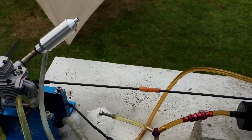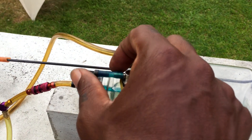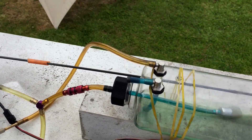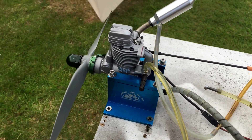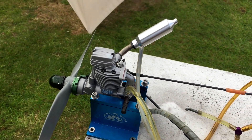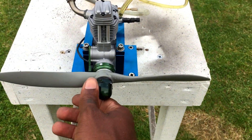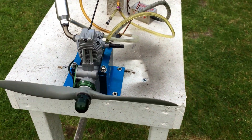I'm using a quarter-inch 32 spark plug, pressurizing the tank. I cap off the tank with a nipple, and I use a normal WD carb vent cap. The tank is pressurized and the engine is pretty much brand new — first start was about 10 minutes ago. The prop is on a bit of the small side; I think it's a 12 by 6.